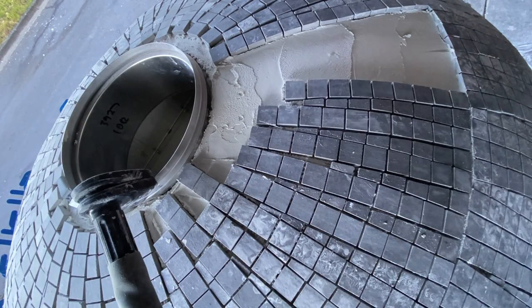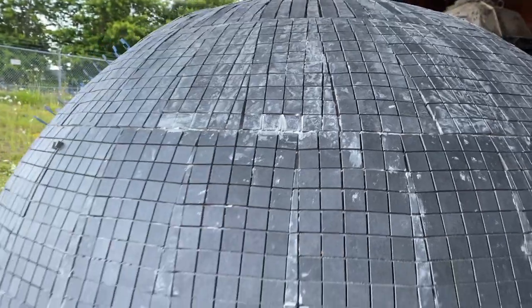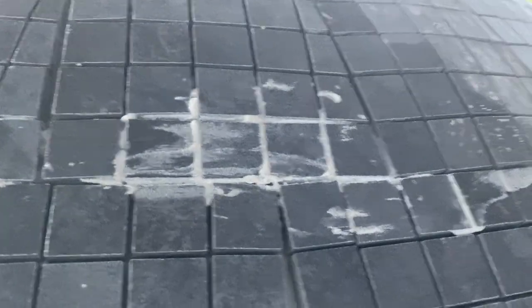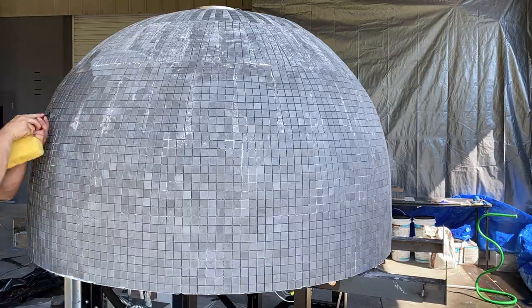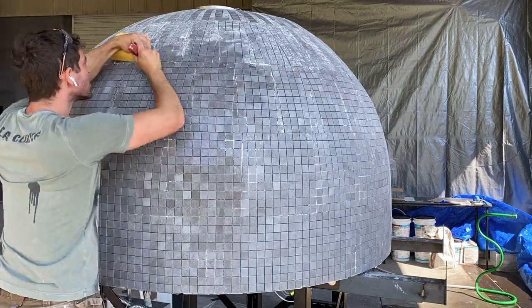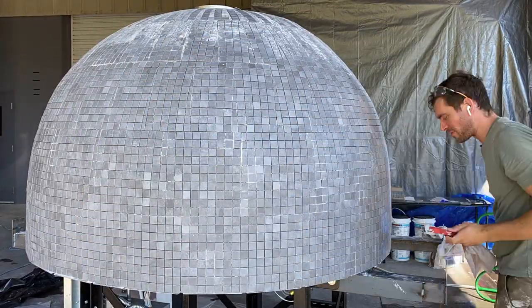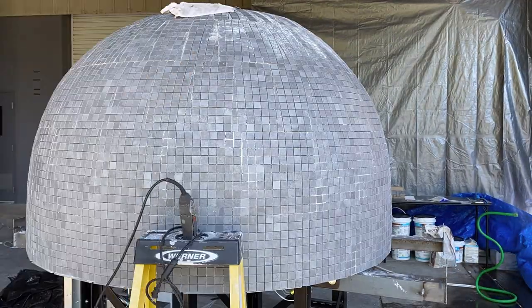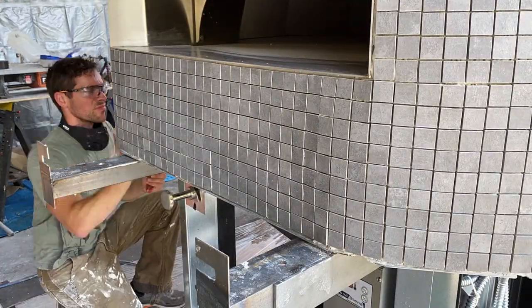If that doesn't make sense, please leave a comment below and I will make sure to answer. After spending a good 12 hours tiling today, always make sure to clean up your grout lines — it's a lot easier now than tomorrow when it's fully hardened. I did not clean up all of my grout lines the day of and had to clean up a few more the next day when it was fully hardened. If you can clean them up the day of, please do yourself a favor and do so.